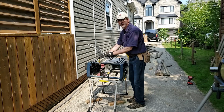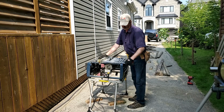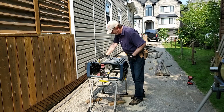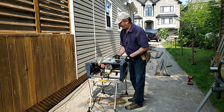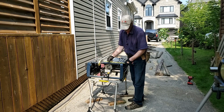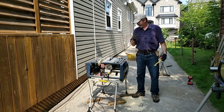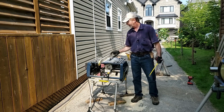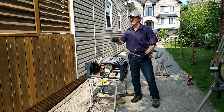1 foot. And also check, a lot of times these will be crooked, so you measure from here to here. Make sure you're at 1 foot, and I got a foot over here. And your center is 2 3/4, and then you lock it down. You just double check your measurement. 1. Yeah. A lot of times this gets a little crooked, so you got to measure here, and then measure center of your blade, which is 2 3/4, right dead center. So that should give me dead center of the blade.